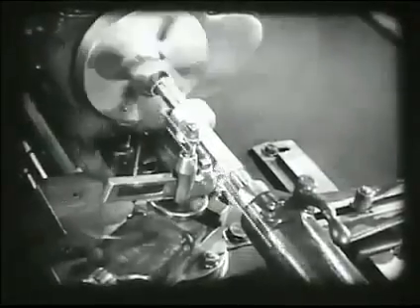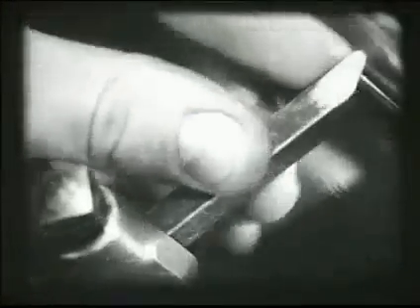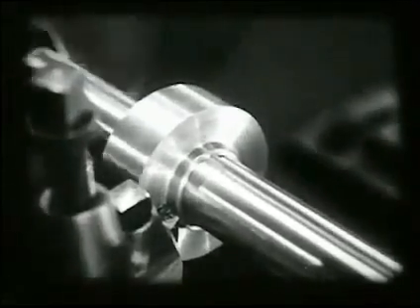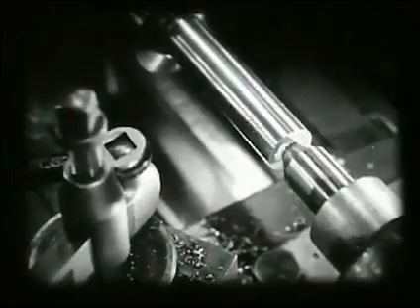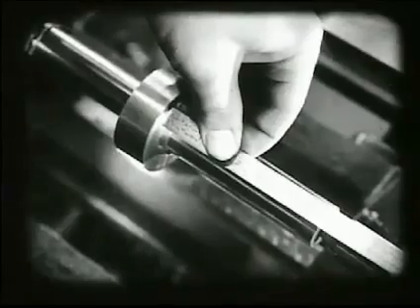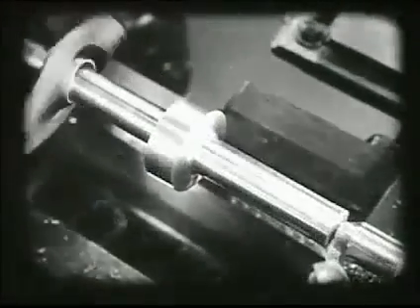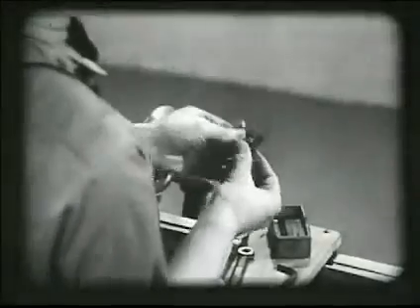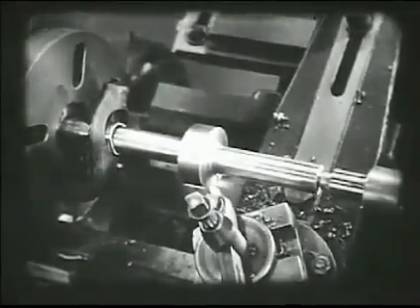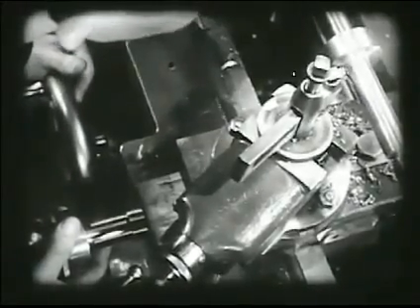The finishing tool is put in the tool post and the finishing cuts on the shaft are made. After the shaft is finished to drawing dimensions, the collar is finished to its correct diameter. The collar is measured with a steel rule and the amount of oversize is noted. A rough facing cut is taken, checked again, then a light finishing cut with a final careful check. The end of the shaft is then finish-faced to the exact length specified by the drawing, using the steel rule to measure from the finished face of the collar to mark the exact spot to start the facing cut. The piece is now ready for the final operation — the making of the fillets. The fillets, which add strength to the shaft, are made with a radius tool set on center, adjusted to cut the fillet on one side, then readjusted to cut the other side. The carriage feed is worked with the left hand while the right hand feeds in the tool.